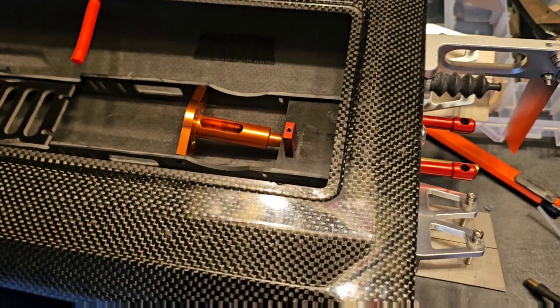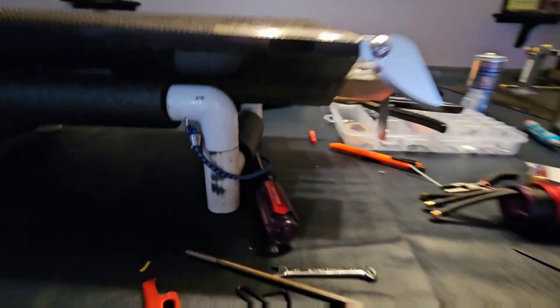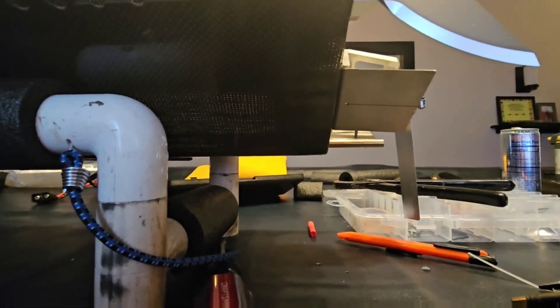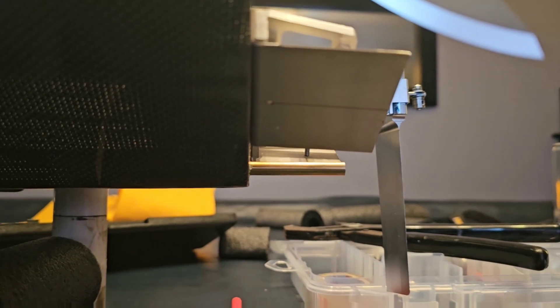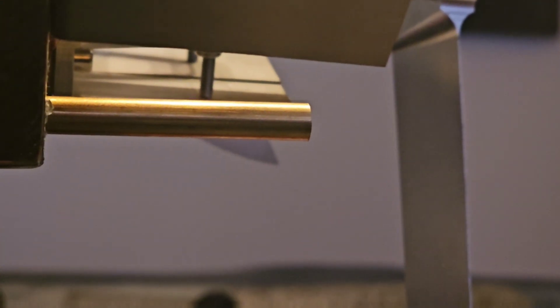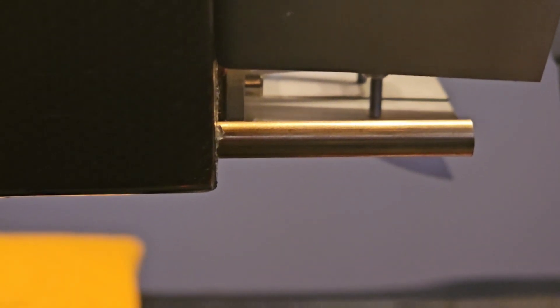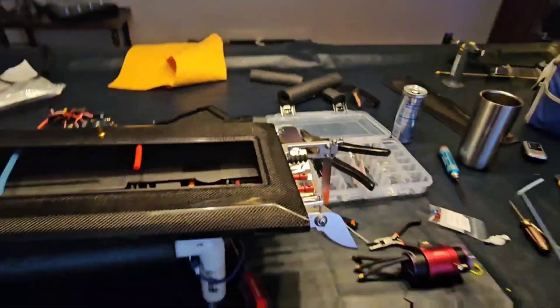I have now been about 12 hours and had to go to sleep. Come back, think about it. I've got the stuffing tube in there and I want to show you the angle it's coming out. It's pretty much coming out level with the keel of the boat. If anything, it has maybe a half a millimeter of upward angle towards this end. But if you were to cut it back here towards the back of the boat, I don't think it will be such a drastic difference.